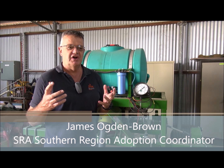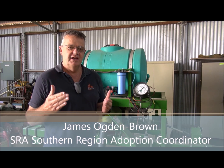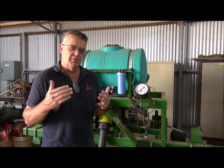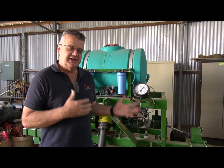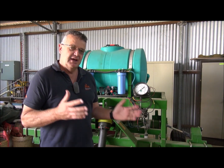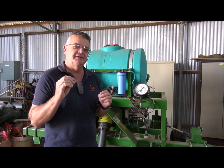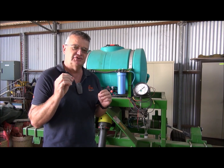Aquatil is using ultra-high water pressure in a jet form to cut through cane trash. What we're looking at is a PTO driven pump that pushes that pressure through a tiny little orifice — through a nozzle of about 0.2 of a millimetre.